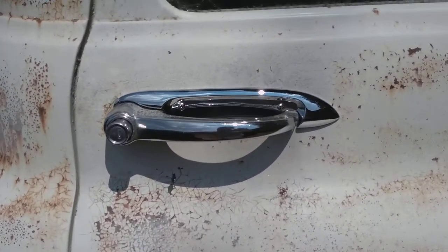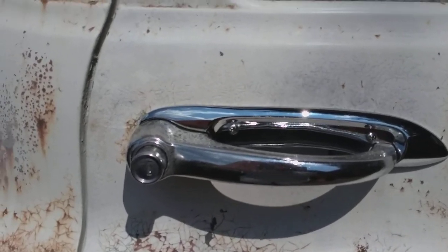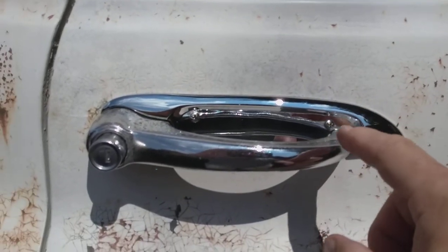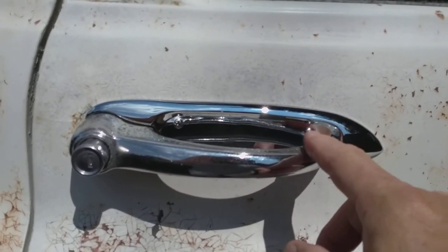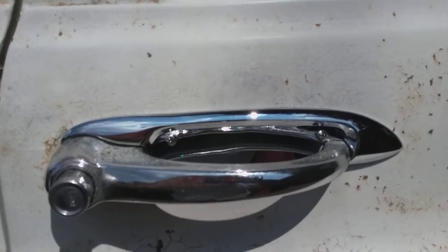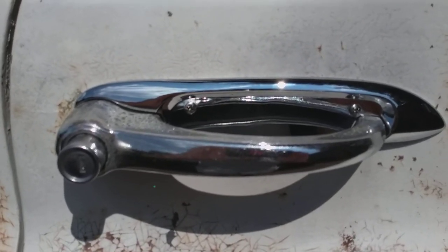I got this side on. I drilled a couple of holes that I'd marked with my marker, put the screws in that were provided, and it went on relatively good. There was another piece of metal behind there so I had to go a little further on my drilling. When you do this kind of stuff, always start out with a small drill bit — you can always go bigger. If you start out too big, the screws won't hold. I'll do the other side and be right back.